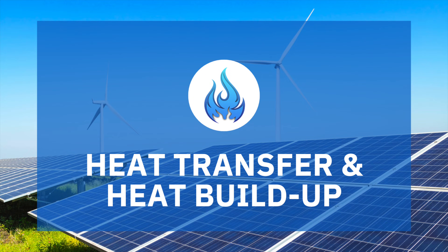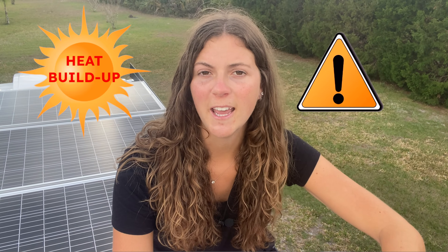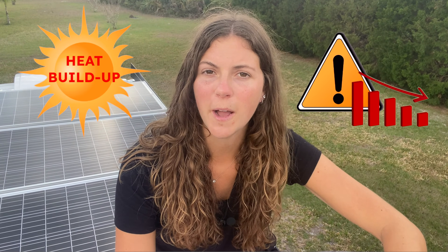On the other hand, flexible solar panels are quick and easy to install since they are thin and lightweight. You simply just tape them to the roof of your van and they stay, so a lot easier to move and replace or fix if you ever need to. Also, since flexible solar panels can be slightly bent without damaging the solar cells, that makes it perfect to conform to the slight curve of your van's roof. However, since the flexible solar panel sits flush to your van's roof, that means that there's going to be a lot of heat buildup and heat transfer that will occur.